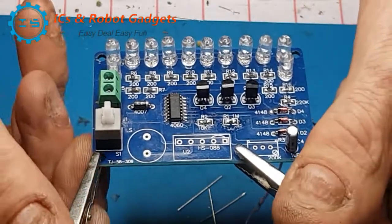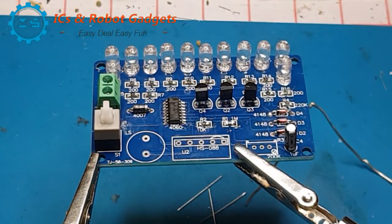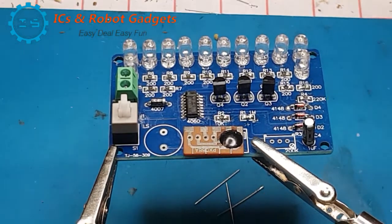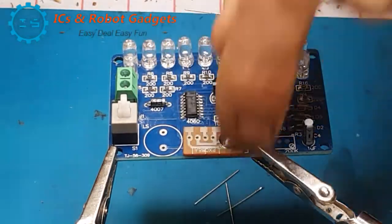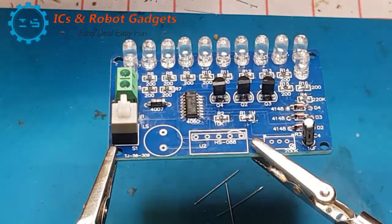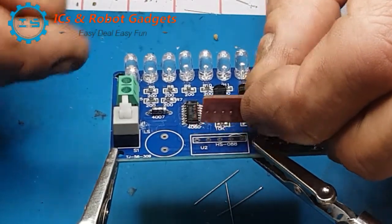So I don't think we've got much choice now. We've either got to put the speaker and the variable resistor in, or we've got to deal with this area, and I'm really not sure what's going on there. Not a lot, but that transistor seems to be sitting through two of them holes, the first two on the left near the speaker. Right, in the picture you can see two of the terminals are connected to the two leftmost. So if that's facing inward, the chip's facing in the board, away from the speaker, like that. I need to orientate the board.